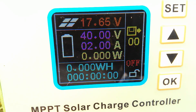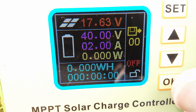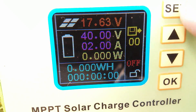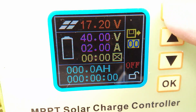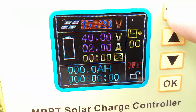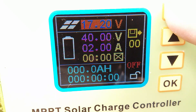This is what's on the display with the solar panel connected. I was having trouble saving the data sets but I think I've worked out how to do it. You press set — I'm using data set zero. So let's press set again. This is the solar panel's maximum power voltage, which on this panel is 17.2 volts, so that's what I've set it to.